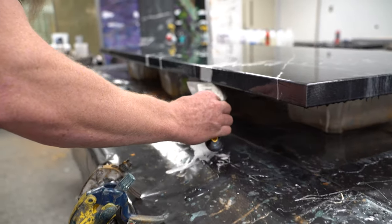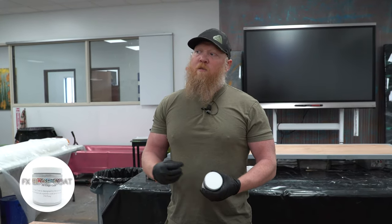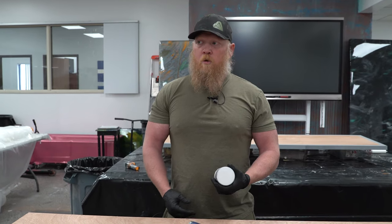I'm going to be explaining everything about epoxy edges. I always apply FX edge coat to the edge. This is not a bonding primer — it's actually a very porous primer meant to allow the epoxy to soak directly through it so the epoxy can still get somewhat of a bond strength to your substrate.